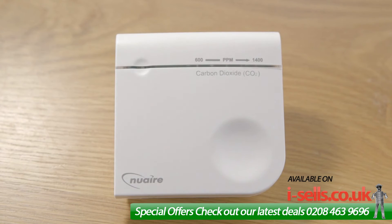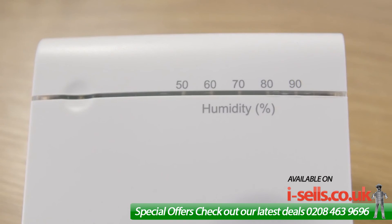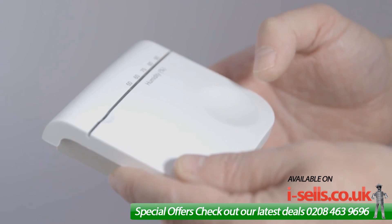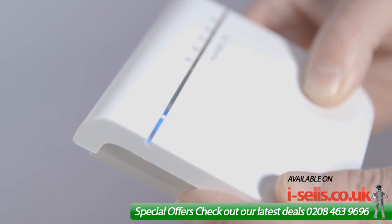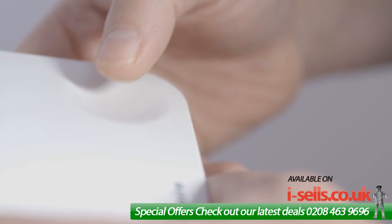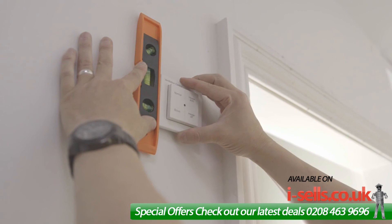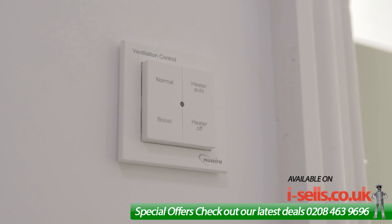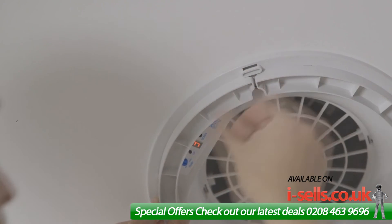If installing the CO2 and relative humidity sensors, put the DryMaster into binding mode as previously described and then apply power to the sensors — these sensors will automatically bind to the DryMaster Eco unit. Alternatively, you can bind the sensor manually by tapping the indent button on the sensor to wake it up. Press and hold until the light flashes red and blue, then continue to hold until you see the lights flash red and green. Release and then tap again — green LEDs will appear confirming the sensors have bound to the unit. Please ensure this process is complete prior to fixing the sticky back switches or sensors to the wall. If it is not possible to position the diffuser at least one meter away from the smoke detector, fit one or more air dams to deflect the airflow.